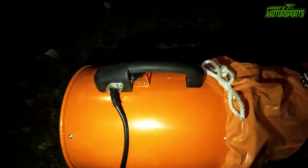But if you're worried about fumes, you could always put another filter on the other side. That way it's double filtered, one filter pulling the air and then filtering the clean air coming out, or however you want to figure it out. This works for me. And if you're working out of a little garage and you're renting or something and you can't cut holes into it, then you could actually just run that vent tube inside the garage to pull the fumes out. As long as you're just using spray paint and stuff. If you start using something more toxic with a spray gun, then you'll definitely have to have a filtration setup for sure. This is just to be safe. We live out in the country now and we're not having to worry about the fumes affecting neighbors or anything like that. So this works great for us.